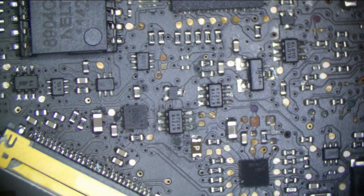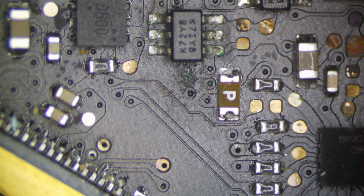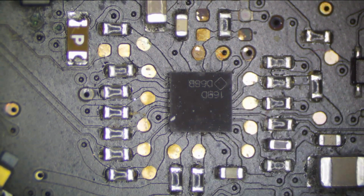This corrosion right here — although it is corroded and you could call this liquid damage — doesn't look too bad. Nothing that would concern me too much. Here's our backlight driver; that's probably not it. Let's look on the other side of the board and look at the rest of the backlight circuit. And — hmm — what do we have here? This doesn't look too good. We have corrosion here, so let's go over to the schematic and board view to see what this stuff does.